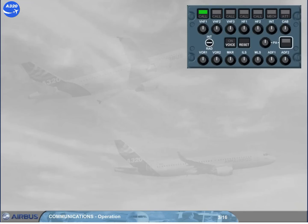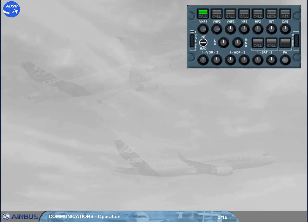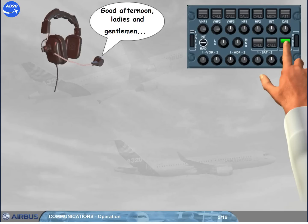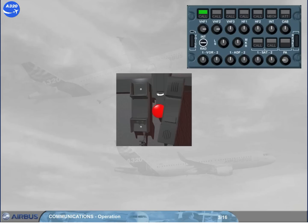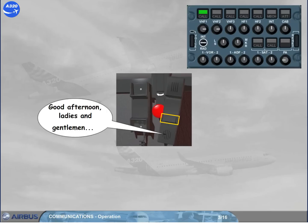Note: as the version of the installed ACP has no impact on its operation, we will now use this ACP. To make a passenger address announcement, two methods are available. First, you can press and hold the PA transmission key while speaking into the boom set. The second method is to use the cockpit PA handset — press and hold its PTT switch while speaking into its integral microphone.